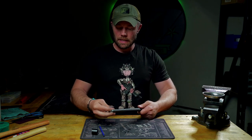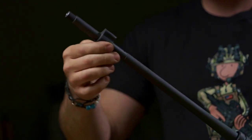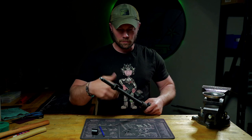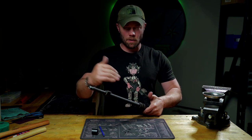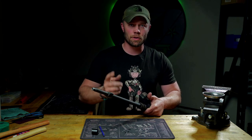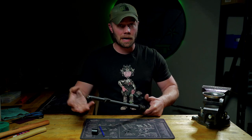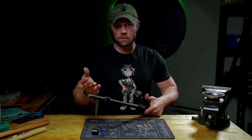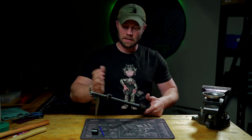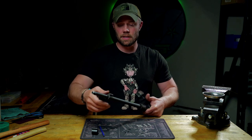Here's an upper receiver group we're getting ready to build. This is a gas block from another company — I'll slide it on here and, as you can see, it's kind of loose. Now we have the risk of bleeding a lot of gas between the gas block and the barrel, which could affect how efficiently the gun runs. If we're bleeding 12 to 15 percent of gas out of the system before it ever gets into the gas tube, back into your gas key to run your bolt carrier group, that could cause problems, especially with remanufactured ammo or weaker steel case stuff — you could run into cycling issues. You shouldn't be able to spin these around like the Wheel of Fortune.